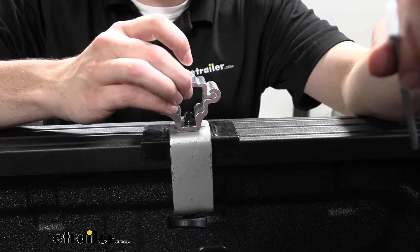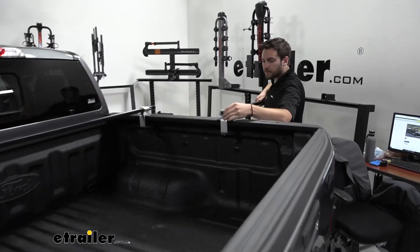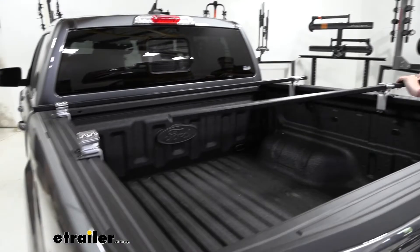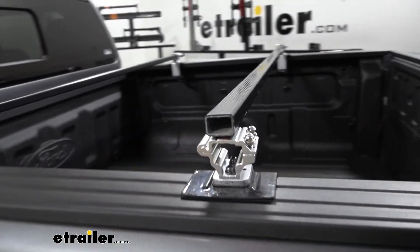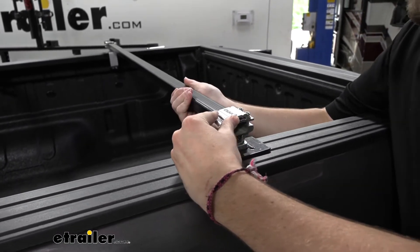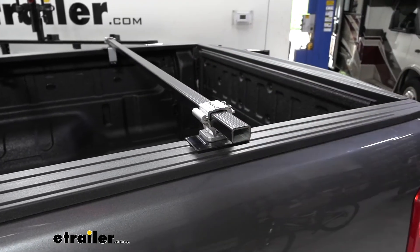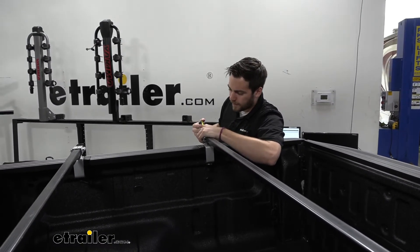Especially once we get it set, just loose enough that we're getting a little bit of clearance here for our bars. So let's go ahead and grab those bars and start getting it run through. Now, you can start doing this in a host of ways, but I like to just start from the outside, inserting through here, kind of walking that clip up a little bit. Once we get it started, it's going to be real easy to sling the rest of our bar all the way through. I'm going to go ahead and rest it on top of there, walk around to the other side, and meet up our bar again — kind of repeating that process, just starting to filter through. Now, we just want to make sure we're a little even. I'm kind of matching up to my other bar. I'll take a quick measurement here — right about three inches from the outside of our clip, and about three inches on this side.